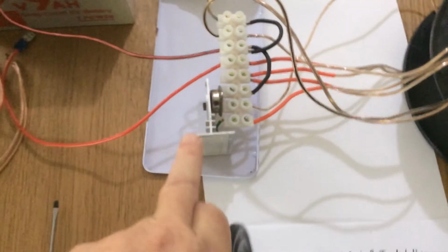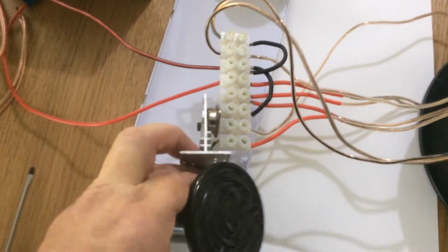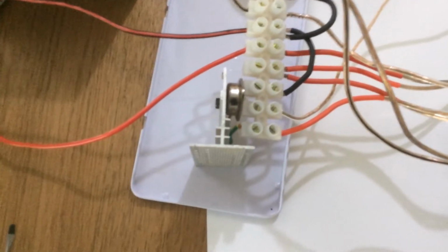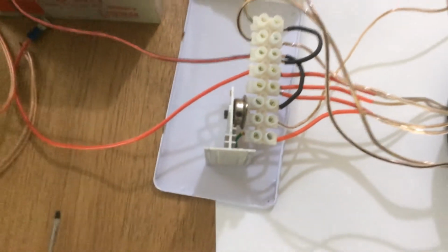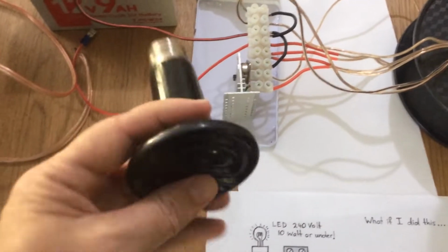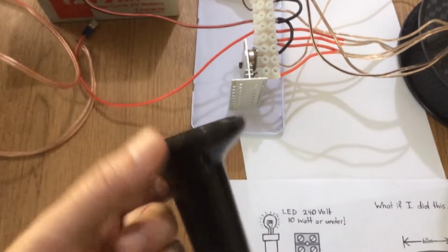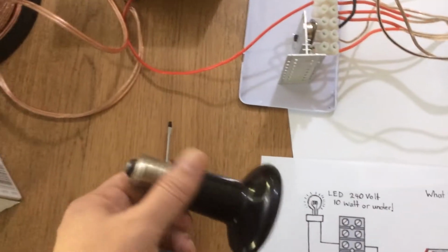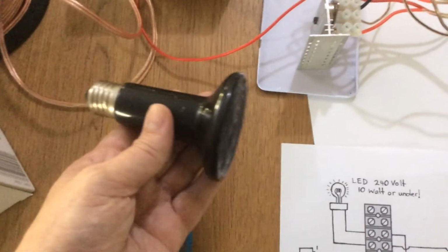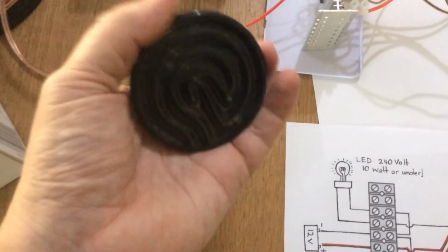You will need to place a bigger heat sink and better connections for this circuit, because that heat sink, transistor will get way too hot if you go running something of this nature. This is like a 70 watt ceramic pet heater, the type of thing you put above or next to baby chickens or something.